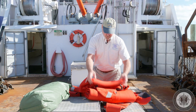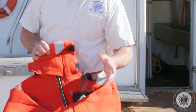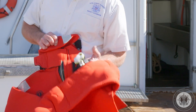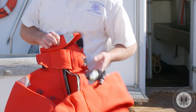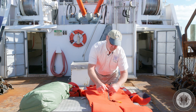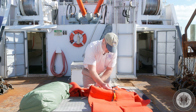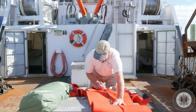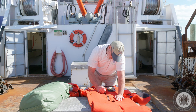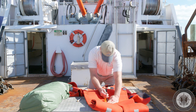This is a universal size suit with an inflatable air bladder. We want to take a critical look at the oral inflation tube. Again, operating beyond the boundary line, you're required to have a Coast Guard approved light. This suit was born in 2011. We cycle the zipper — it seemed a little sticky, so we apply a simple bit of zipper wax and cycle it again.